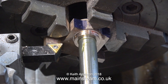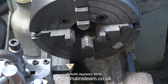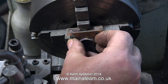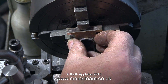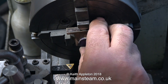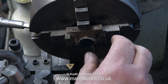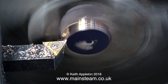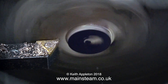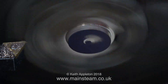Here's the clever bit. All I have to do is remove the finished component by slackening off the top jaw and the jaw nearest to me, then fit the other bearing — tightening only the top jaw and the one on the left. That way the bearing block is in pretty much the same position as the other one. I can resume the machining operation exactly as before, and don't forget: when parts are soft-soldered together, take it easy.